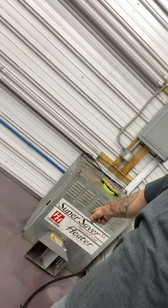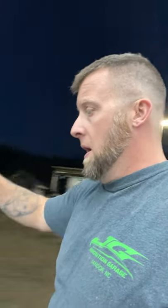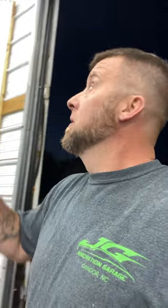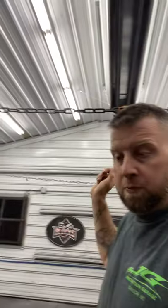This right here is what that old guy had the other day — that right there is 225,000 BTUs of pure love. The other day when I done the trim out in the C10 and painted that Toyota because Cody was sick, I put that sun gun right there, turned that bad boy on, pulled the garage door down, had the big door shut and was only using the lower filter banks — and it stayed 80 degrees in here. But I had some trash issues because of turbulence circling up the air. Even though both fans was pulling out 32,000 CFM of air, it still created turbulence.